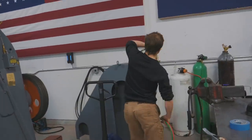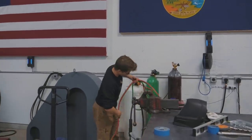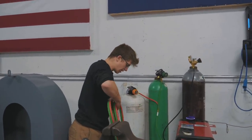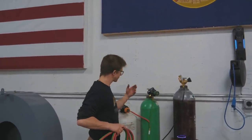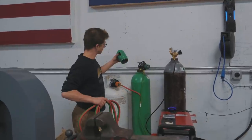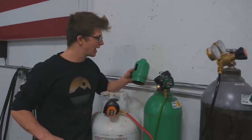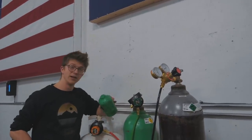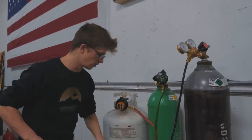So that's good — we've got fire. Now, as you'll see, the bottles are not on a cart. I'm waiting for a cart to arrive — I ordered one so we make sure that oxygen bottle doesn't tip over. In the meantime, we're just going to tie it to this conduit. Bottles are dangerous when they fall over, especially without that cap. What's interesting is here in America this cap comes completely off, which is very different from back home in the UK where the caps stayed on and just had an opening for the regulator.